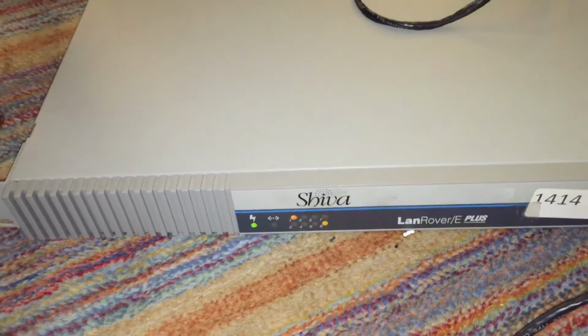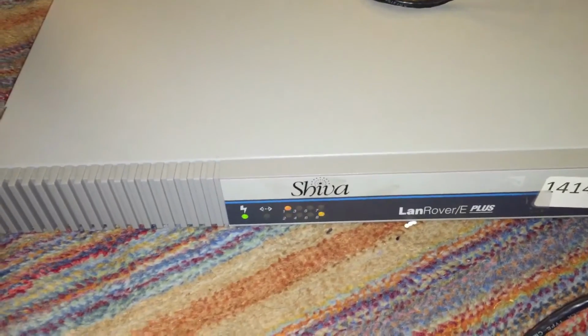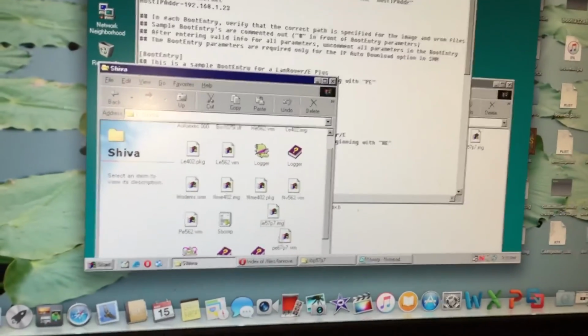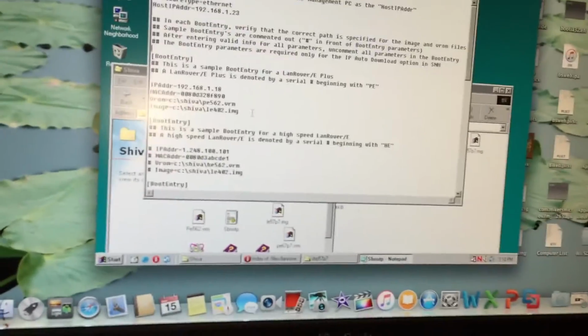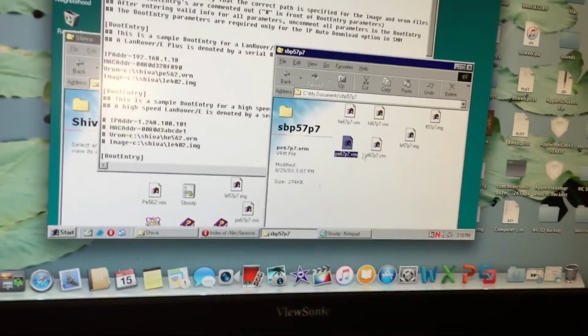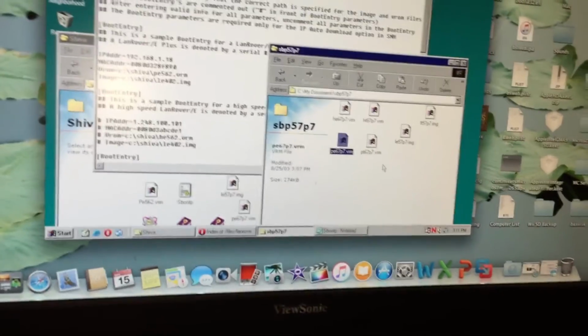Alright, so my device ended up getting stuck on the green blinking LED state, so I went ahead and reset it. And if that happens for you, that probably means that the firmware files that were located in this folder, referenced by this file, were too old. So I downloaded the latest versions I found online. I will put a link to these as well.